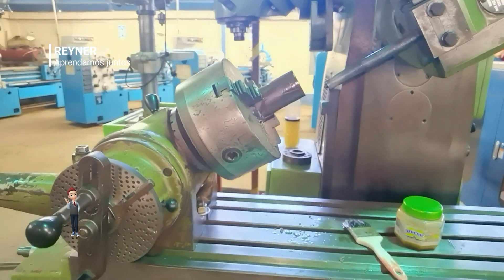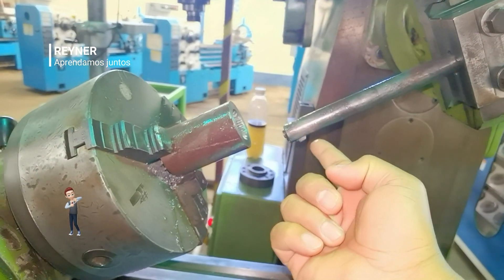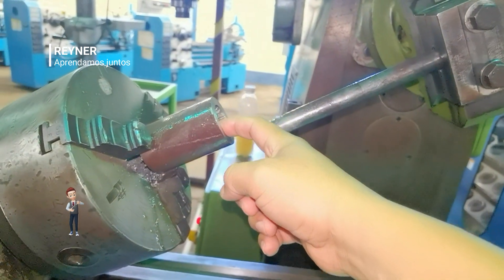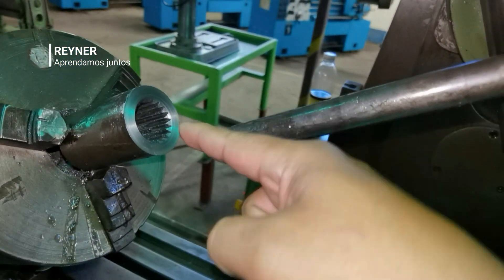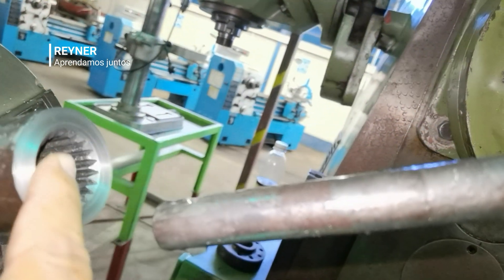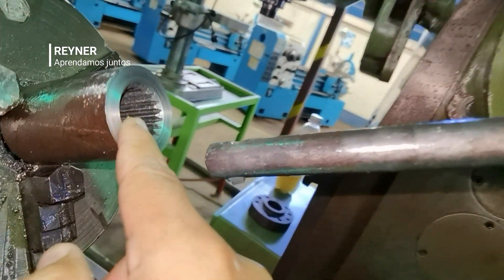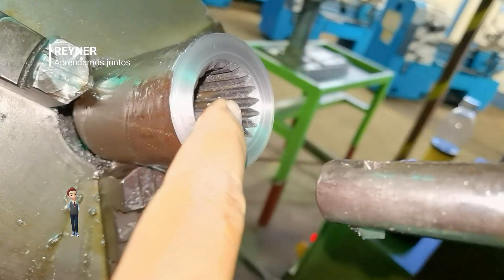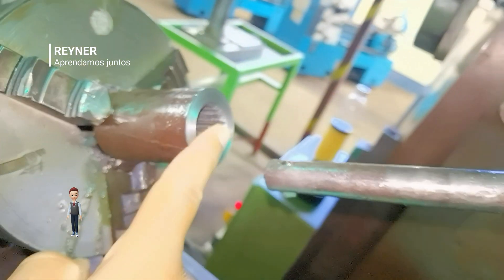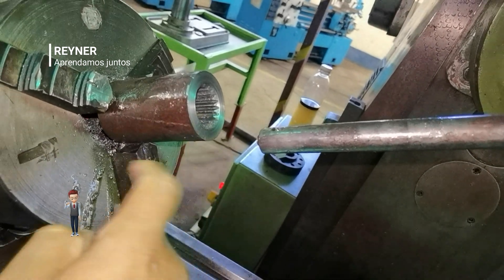Now that we have finished the machining, there are some precautions to take into account. We have to align correctly so that the cutter — this dimension from here — from the height of the cutter with the diameter of the bore — is a condition we must take into account, as well as the length, so it has to enter freely. Also, when we are machining — something important for safety — never put your finger here while it is machining, because the cutter will send a piece of finger to the other side.